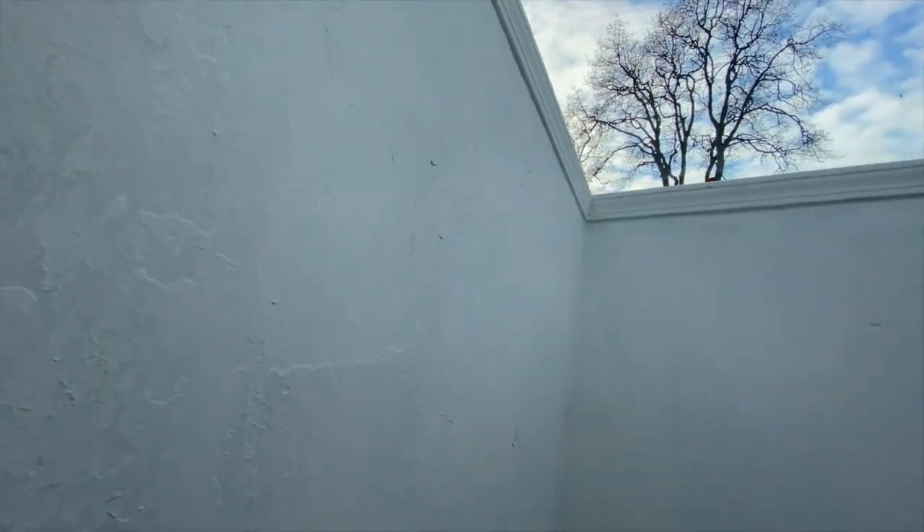Is it advisable to put a second coat of primer just to seal that down, or is that not necessary? Generally in most situations I don't feel like it's necessary if you're going to get a good solid base down. But once you get up into that skylight, I think you're going to really notice what type of damage is on that wall. If it is definitely a high-moisture space, you'll get a gut feeling being an experienced painter — it might be worth spending the time to put another coat on just to make sure you've got a really good seal.